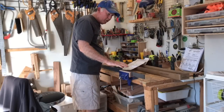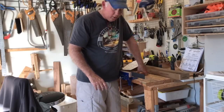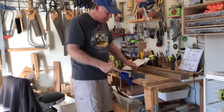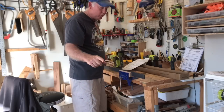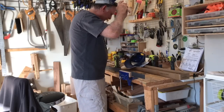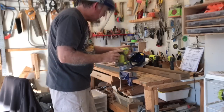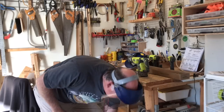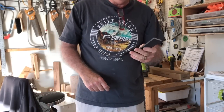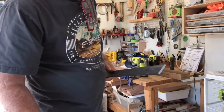This is half the bar that will go on the wall to mount it, and it's about 10 inches too long, so we have to cut off 5 inches from each end. That way I can still use the existing holes and won't have to re-drill them. Let's get this cut. There we go. Never pick up the end you just cut — it's too hot. The other side is cool. There are a few sharp little burrs on that, so we just need to put a little file on it to get rid of those, and we'll be ready to go.